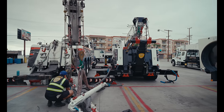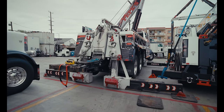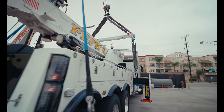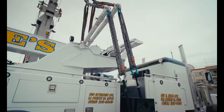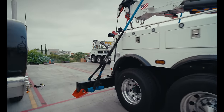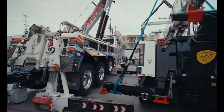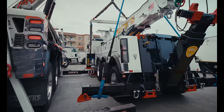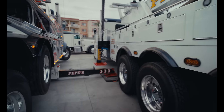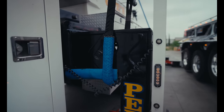And then you'll see what I'm about to do for the rear. This is what it looks like with dual spreader bars in the front - ain't that a sight. I'm doing this because with the single spreader bar, not only will I exceed that, but I'll exceed the limit of the snatch block, the lines, and the rigging. Never exceed your working load limit and your equipment will last forever. I now got the Bailey's Platinum slings doubled up, two on each end. The only rigging that stays the same is my six-foot sling, because this baby is rated at 52,000 pounds in this configuration.